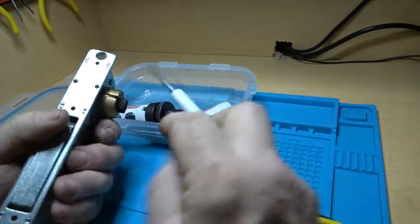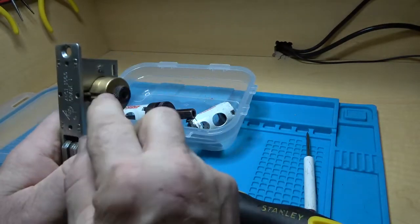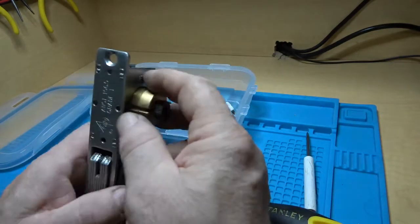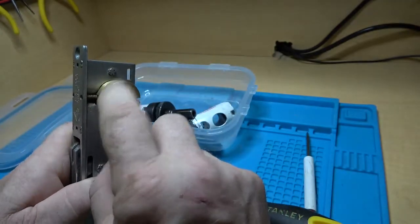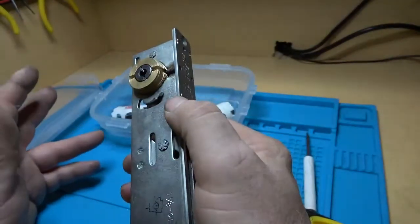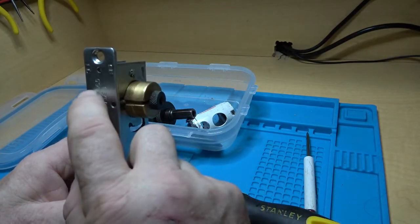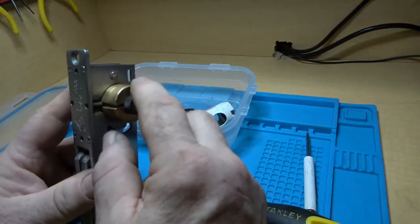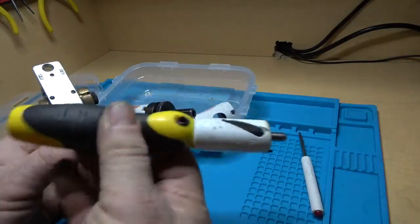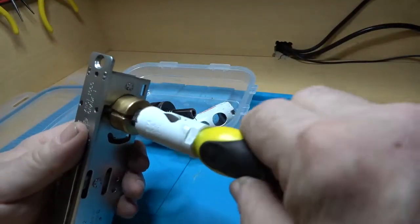When I did this video I told you there were two uses. This is used on normal mortise cases or cassettes, depending on your part of the country or world. If I want a drill guide to drill through a hollow metal door or wood door to put a cylinder on a side that didn't have one, I use this — perfect hole every time, don't have to take the mortise case out. Now I've either got a thumb turn or key cylinder on the other side. In the most recent job, the manufacturer put the prep on the wrong side, so I moved the cylinder and put a dummy on the other side — doors didn't have to go back to the factory.